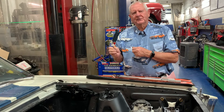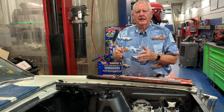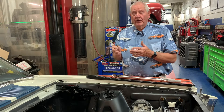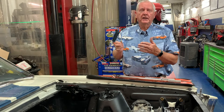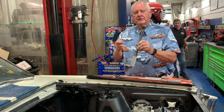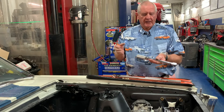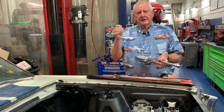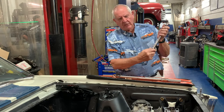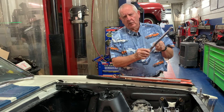Now, what do you do to know that the bolts are tightened up? Because lots of guys don't know what's tight and what's not tight. Most people that work for me when they first start — training them — they don't know tight, so they end up too loose. That's why we've gone to torque wrenches. This is an example of a 3/8 drive torque wrench that we would use. You can look up on a chart on the internet and it'll tell you for a 5/16 bolt how tight it should be. You make your adjustments here by turning the bottom of this to whatever tightness you need, like 15 torque pounds or 30.